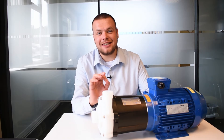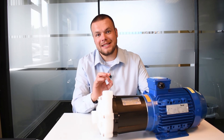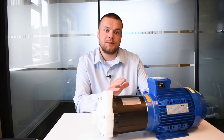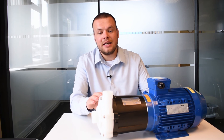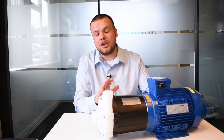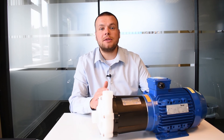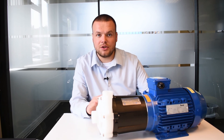Here's a good example of a mag drive pump — I've got one right in front of me. This is from the Tapflow CTM range; specifically this is the 40 series of that range. It's got a 2.2 kilowatt motor and a polypropylene head. You're going to get about 16.5 metres cubed an hour max flow out of the pump, with a max head of about 18 metres. This one is going to a chemical factory where they're pumping a chemical on a simple transfer duty.